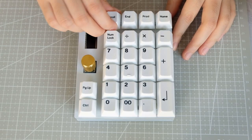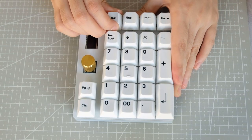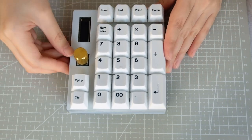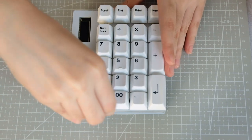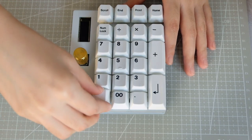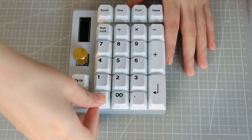The rivets are about as good as your plate. With single switch plate holes, you can lift up the entire board with one key. However, in places where the plate holes are larger to accommodate many layouts, the switches come off very easily. Overall, I think they are a decent hot swap solution for tray mount or similar boards where the PCB is screwed in.